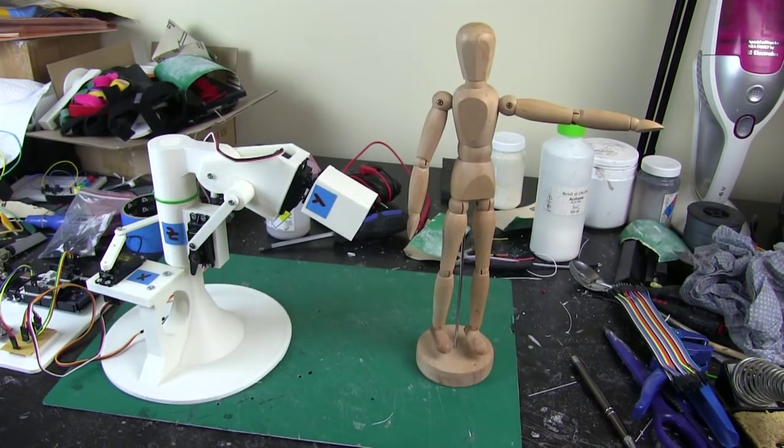So let's have a talk about why it's built this way and what we get out of the inertial measurement unit. The Adafruit Absolute Orientation sensors give you results in Euler angles for X, Y and Z, which seems fairly straightforward, 3 axes for 3 degrees of freedom. But actually there's quite a lot of maths online and quite a lot of reading, and it's actually quite confusing when you first look at it.